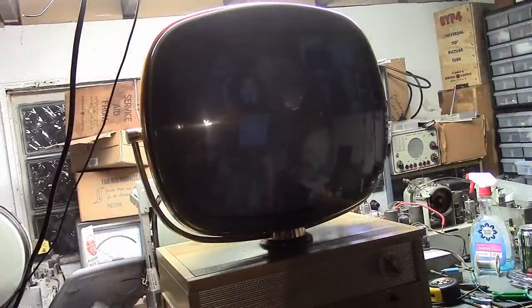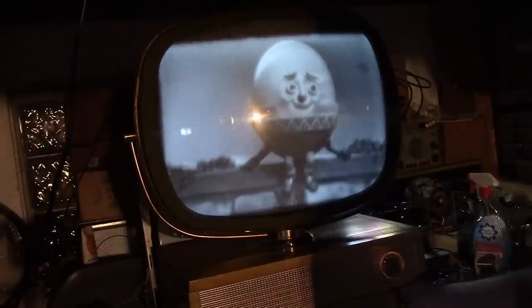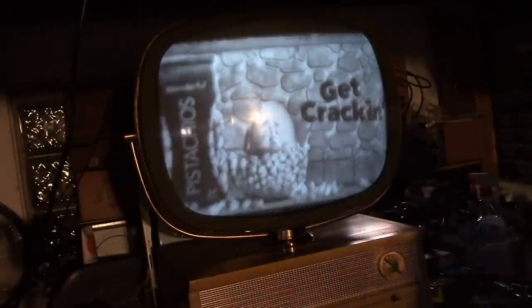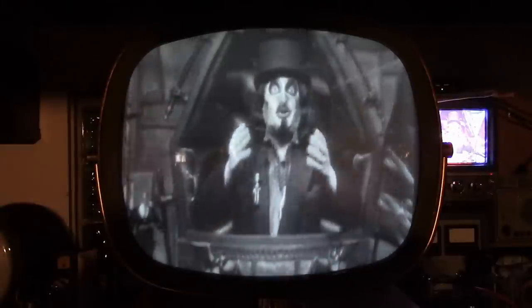When you superimpose it over another shot, the brighter object is all that's visible — interesting! This picture tube is a little tired, if you recall from when we tested it. So let's let it run for a while and see what happens. It's an original — I'm wary of trying to rejuvenate it because I've never had any luck with that. But I suspect if we let it run for a while it'll get better. The sound is fine, the reception is fine, it's a good sharp picture — just a little dull, but it's getting better. Just as I'm talking, it's getting brighter and sharper. It's been playing about an hour with no issues. I think the picture quality got slightly better, so we'll go with it. I'll get out my test pattern generator and make the final tweaks, and I think we can call this one done.